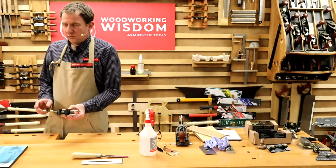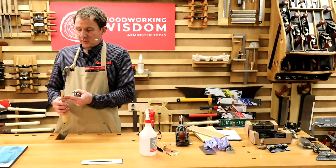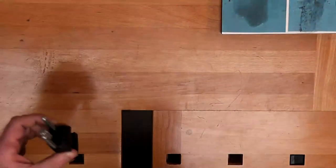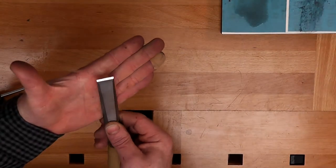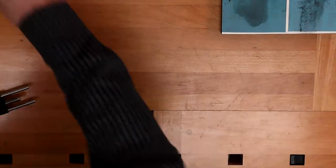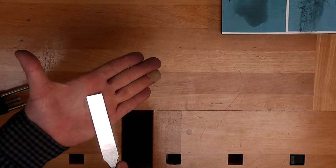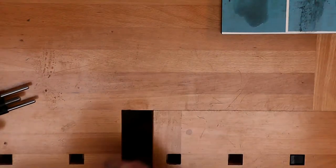At the moment, we've done our wood chisel. We've got a good edge. I'm going to buff it in a minute. It looks nice. I polished the back. Fantastic. The nice thing is I've got a repeatable front edge, 30 degrees, nice and square across the front. Difficult again for you possibly to see, you might see the shine change on there. That's what I'm after. I'm trying to get something that also looks square on the back, so I know it's giving me that accuracy, which is what we all want.